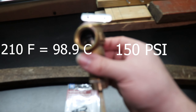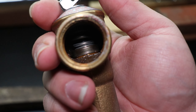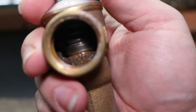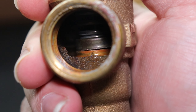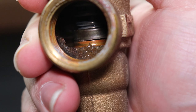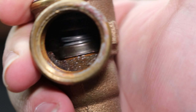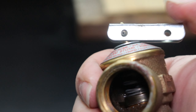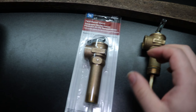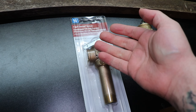The third reason this could potentially leak is that when these things do leak, whatever sediment or buildup that is in your water or in your tank starts to slowly creep in and get into that little collar. So where the seal is supposed to sit, sediment will take its place, and then it will either stick open or just kind of corrode shut. Some people say open this all the way and slam it down a couple times to loosen that sediment. I say no, don't do that. Even with brand new ones, you shouldn't be fiddling with this. Just let it go.